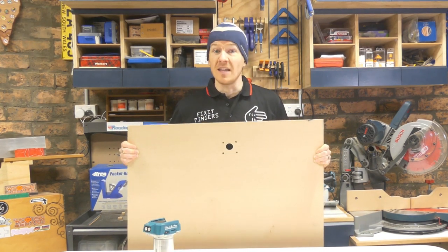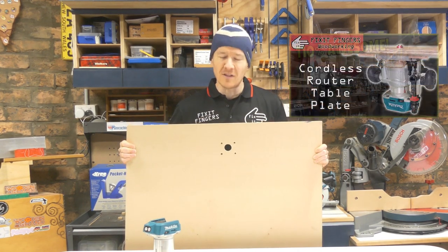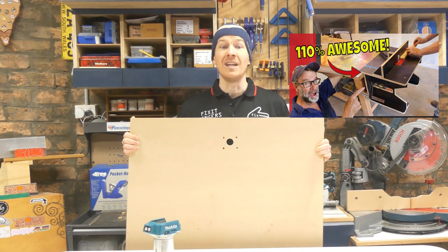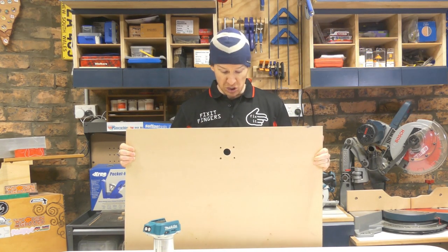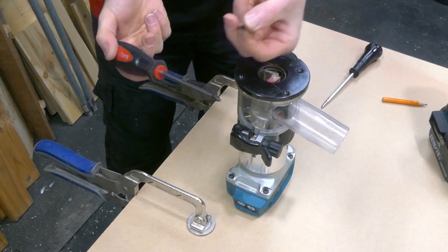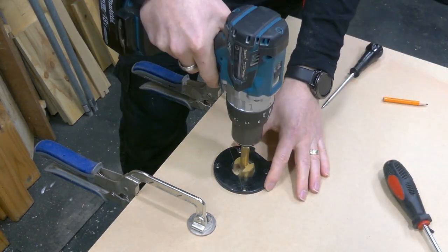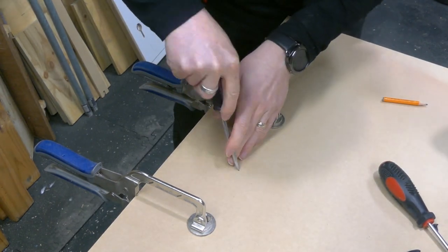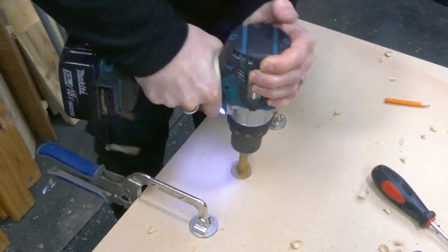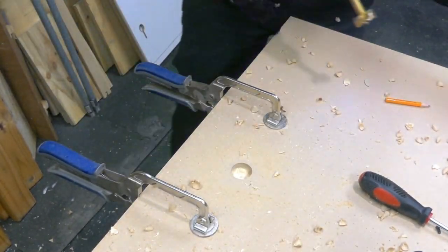You can go back and see how I made my proper router table, and if you're really keen there is a super duper DIY version of this which DIY for Knuckleheads, Uncle Knackers, has just put in as part of the Woodjigs 21 challenge. But if you want to knock something up in literally five minutes to turn your trim router into a router table, here's how. Grab yourself some sheet goods no thicker than 12mm or half an inch. Get your trim router, take the base off, and find a Forstner bit or other hole-drilling device of a suitable size and plough a hole straight through your new table.